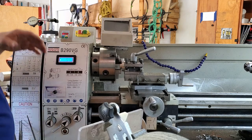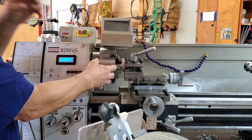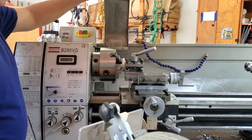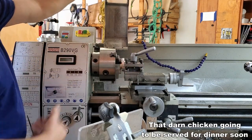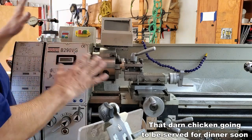That's a great safety feature, but you have to wait for the VFD to clear all the codes and then you're ready to go again. What I decided I wanted to do is add a switch right here so I can turn the lathe back on and off, and whatever speed I was using to cut with, stop, switch, start — same speed, don't touch any of this.